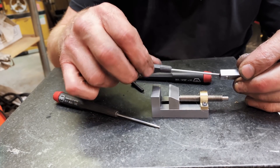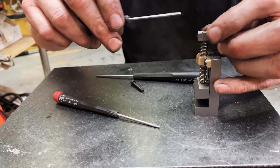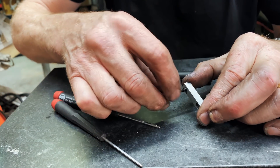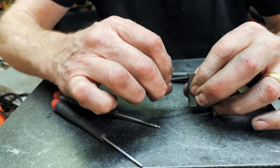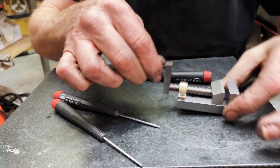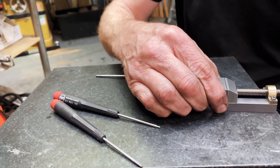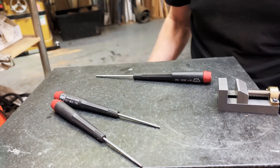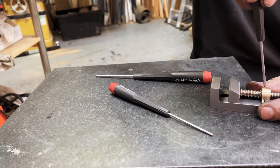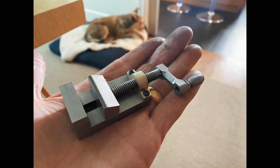This is a set screw that goes in the end of the handle. The handle is still unfinished — still just a square of steel right now — but I'm testing operations. I've milled a flat on the end of the threaded rod that the set screw grabs, and this 6-32 long machine bolt will eventually hold on to the handle, the little spinny handle. That's a vise! Look at that! It's not quite as easy to turn as I eventually got it, but yeah, man — so exciting!